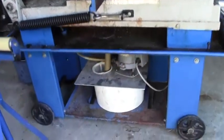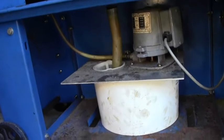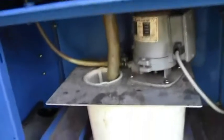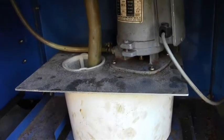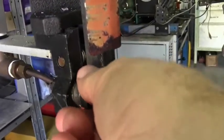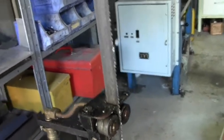Here's the cut-off saw with the coolant pump that's given me grief over the years. The original plastic tank was rubbish, so I cut off a heavy duty plastic bucket, made up a bit of a top and put it on there. I'll show you the problem with the pump blade and wheel. The other thing that's wrong with it is these guide bearings - I think that one's seized. They're all corroded, so it's time to replace them with stainless steel ones. That's the job for today.